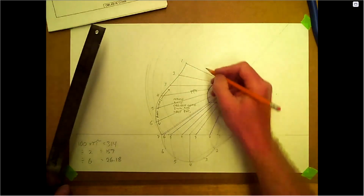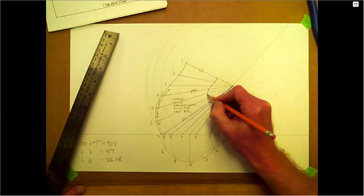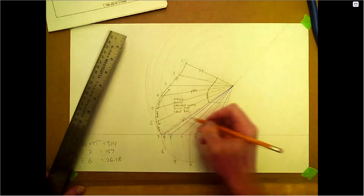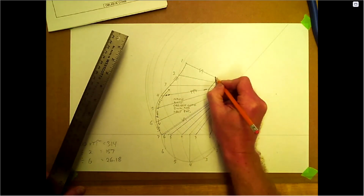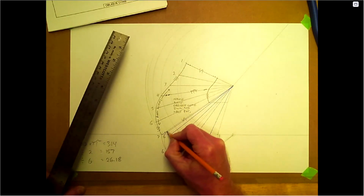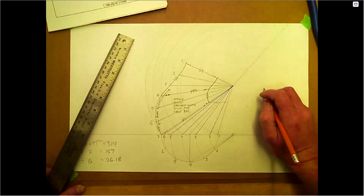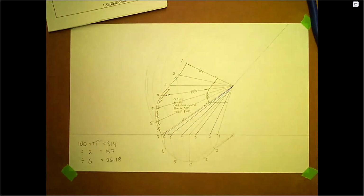What else we got here? I guess we got a sheared edge here. We got a shear edge here. Burnt edge here. Burnt edge there. Quarter marks, I guess. We can go here and here on center. Our ends are quarter marks. Those would be punched through on the plate anyway. Some people like to punch the hole outside when they burn. And I think that's about it. There we go. Drawing 10, the oblique cone.